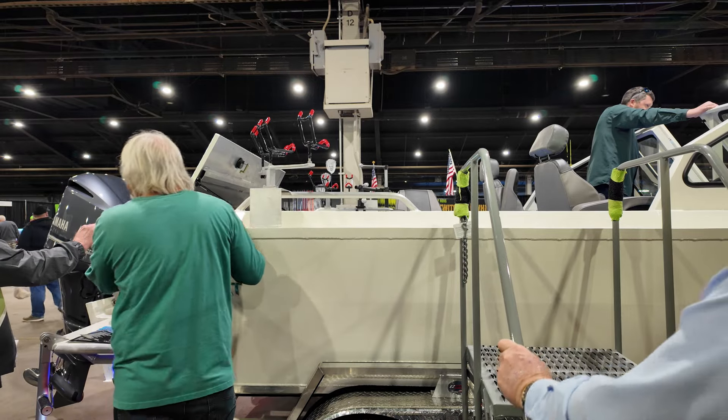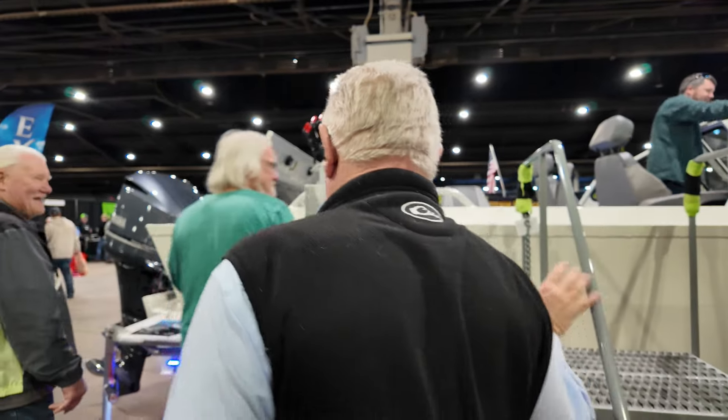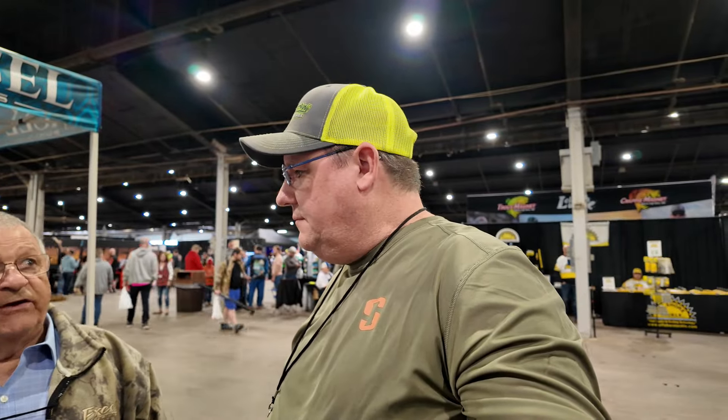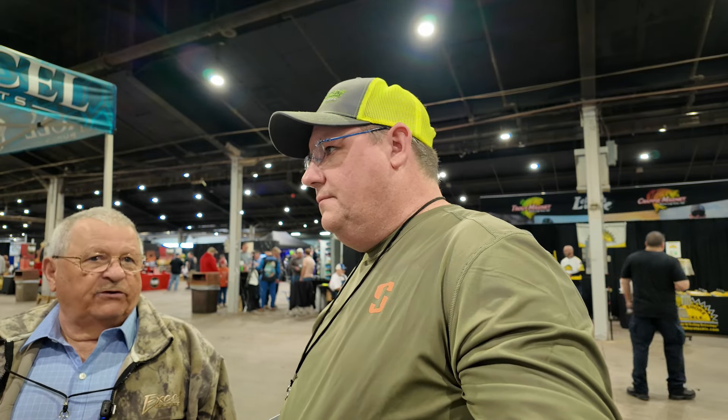What I did with this boat for Midwestern fishermen — if you buy this boat from one of the companies built out west, the windshield is fairly forward because we only need the front deck to drop an anchor. So I moved the window back a foot, kept the high sides of an offshore boat, put a pedestal seat up front, a butt seat, trolling motor, fish finders up there. It's got a place for all your storage boxes, planer boxes, dry storage in front, and an anchor locker.